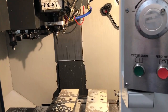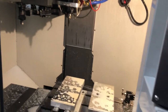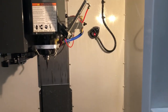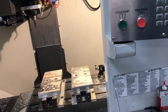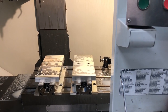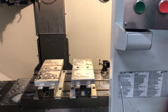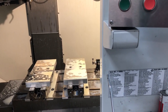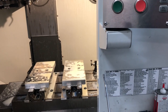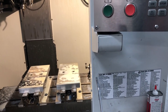On the pro side, axis acceleration is super fast. This machine has more axis servo thrust in the X than a VF2, VF3, or VF4 for that matter. They basically take that servo power and turn it into axis acceleration on this machine. On other machines they may have the rated thrust for cutting power, but on this machine they use a high-pitch ball screw and use it for acceleration.